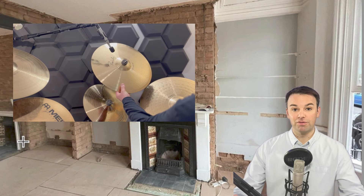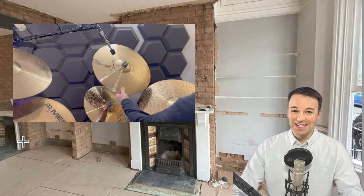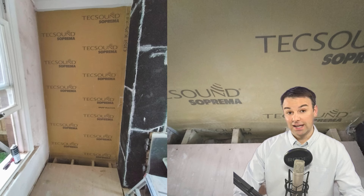Because of the weight of the sound deadening materials — the viscoelastic membranes, the 20 mil rubbers — that's going to pull off any blown or loose plaster, so you have to make sure the plaster is structurally sound before applying them. Because they're hearing TV, conversation, and music coming through the walls, the walls are like a ringing drum cymbal and you need to sound dampen them. You can't just build a frame or clip-and-channel system in front of them — they need to be sound deadened first, just like putting your hand on a ringing drum cymbal. These first layers in the alcoves with the viscoelastic membrane, and over the chimney stack with the 20 mil rubber — that's exactly what we've done, tucking it down beneath the floor and those other flanking areas.